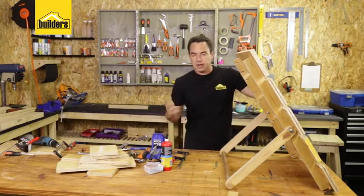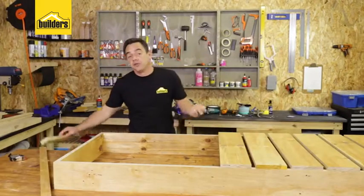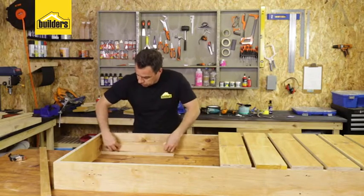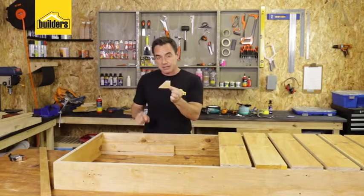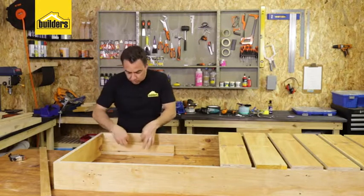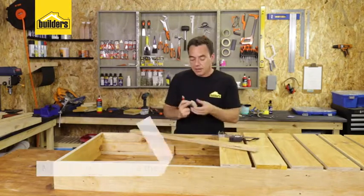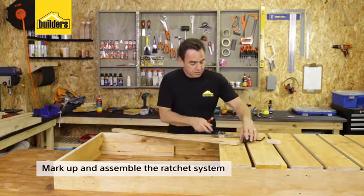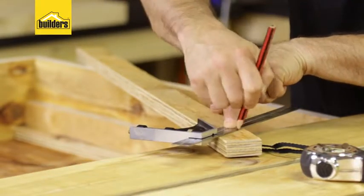Let's clear the desk and bring the box back. For the ratchet system: we've got a runner on the bottom, and I've cut little wedges which are going to be sitting in place. We're going to have numerous ones of those all the way along, making a sawtooth rack. I've taken 30mm on the top and then cut down at 45 degrees — very straightforward. I'll mark out 30mm at 45 degrees with my set square.